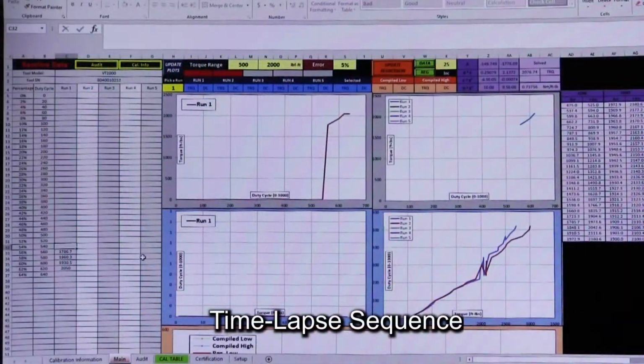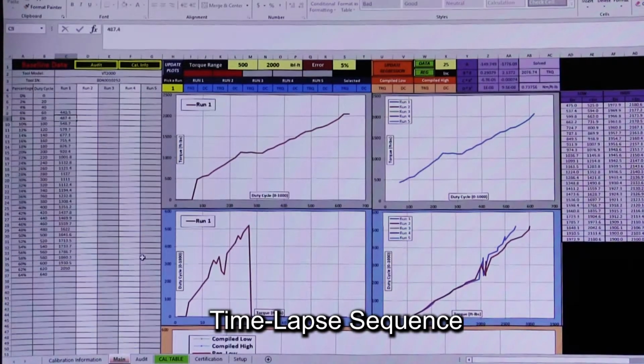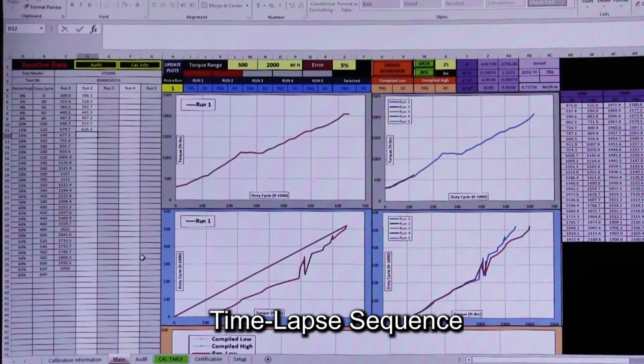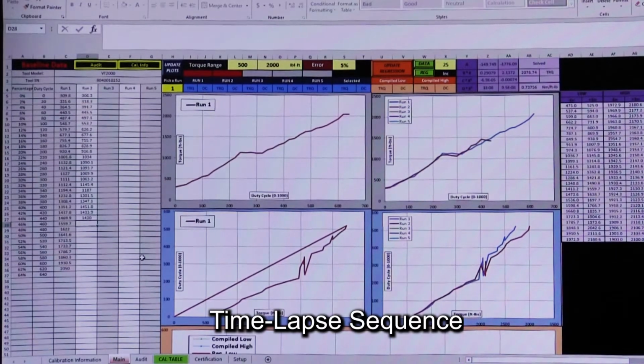The first step in calibrating a Volta is to set a baseline for the motor and gearing efficiency. During this process, we are establishing the stall torque readings at various voltage outputs. Once this data has been collected, our software updates the stall torque readings and duty cycle for each torque setting, and the tool is flashed with the calculated settings.